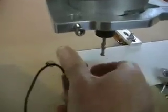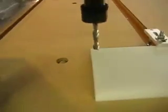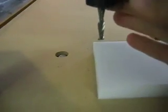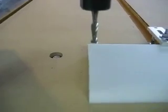If you want to find the edge of your workpiece, move the tool so that it's up against the edge. Then come over to the screen and tell it to search in the negative Y direction and click on that. The tool will move in until it hits the edge of the plate. Now we've got our cutting edge set right up to the edge of our workpiece — it can all be done very accurately. Of course, you have to make sure your tool is set so that the furthest out point is going to touch the plate. And that's it.